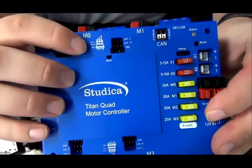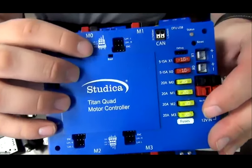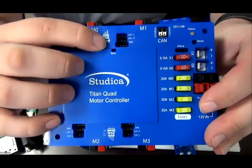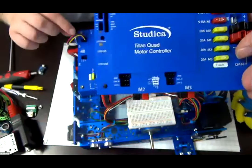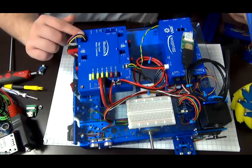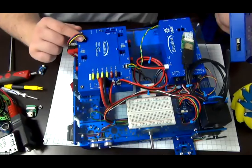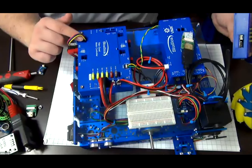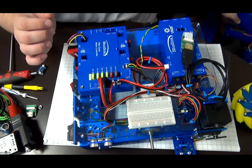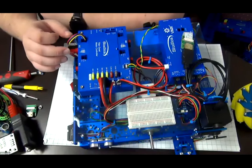If you look at the silkscreen, the encoder is the bottom port, which is the 4 pins at the bottom. There is a pinout, as you can see, there's plus A minus B. That matches the cables that are coming here, where you have the red cable being your plus, the blue cable being your A, the black cable being ground, which is your minus, and then the yellow cable being your B, as we are using quadrature encoders, so you have an A and B signal.